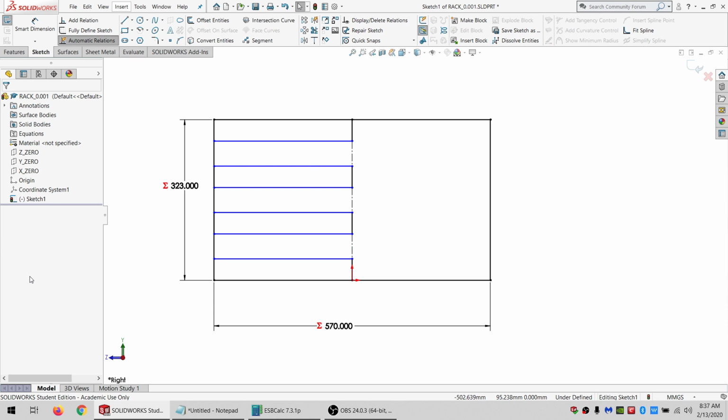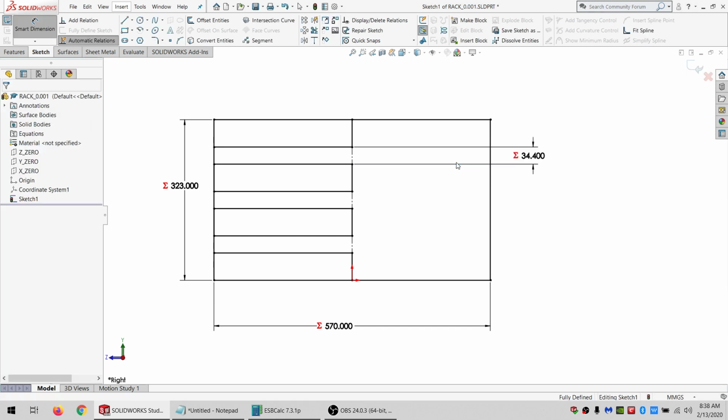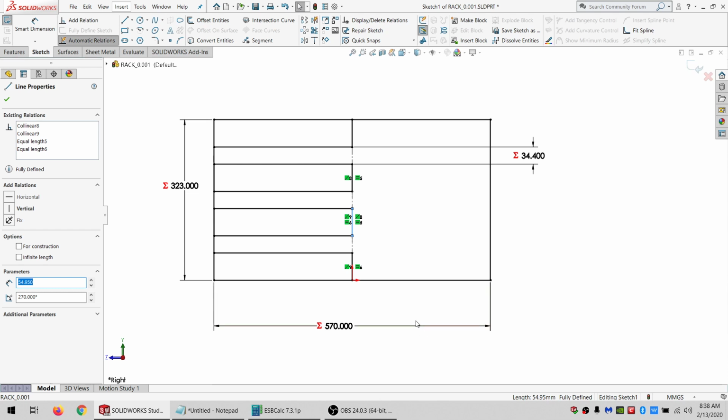And then I have to kind of ask myself, how thick are the shelves going to be? So this is the thickness of the shelf itself. So this is going to be equal to a material thickness, which is probably 4.4 thereabouts. Plus, then I have to think. I want a piece turned the other way from the vertical instead of horizontal to give it some structural rigidity in that plane. And thinking just off the top of my head, and I could probably do some math and figure out ideal, but I kind of want to overbuild it because it's scrap wood. So I'm thinking 30 millimeters should be plenty. So that gives me openings that are about 55 millimeters tall. I think that'll work.